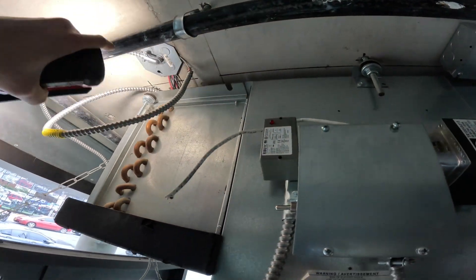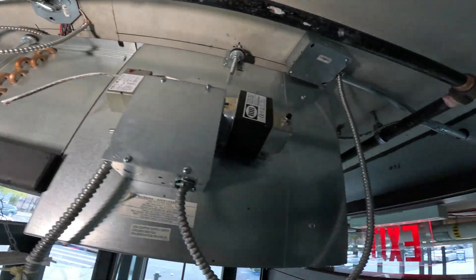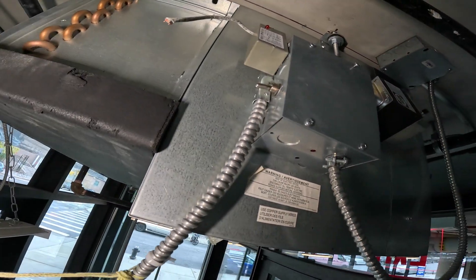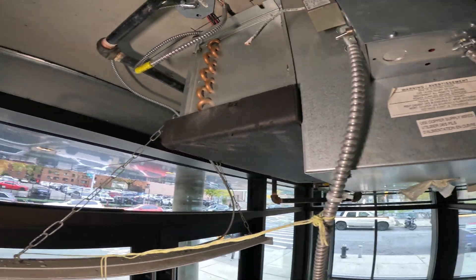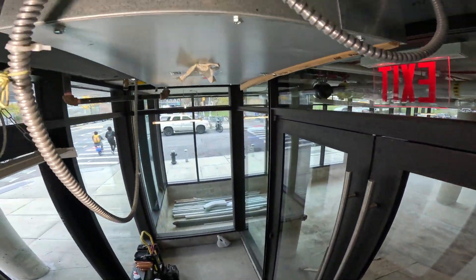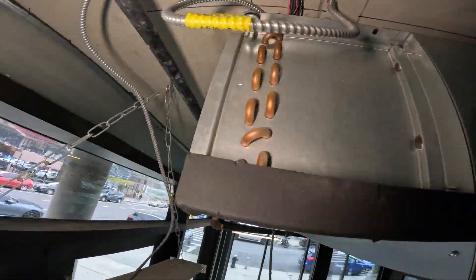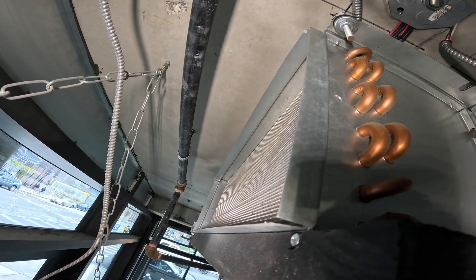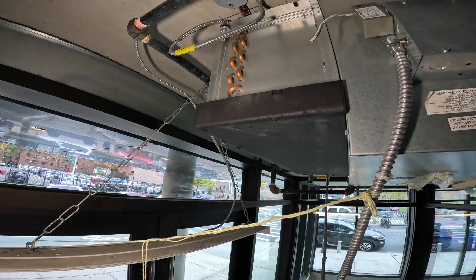Look at this — you got a cable here, cut. I see power lines and stuff coming in here. What's controlling the temperature? It's just for this little entrance way. The return air is here with the filter, and this is the supply air. This is the hot water coil — they're only using this for heat. And this thing is blowing against the wall. Very strange.